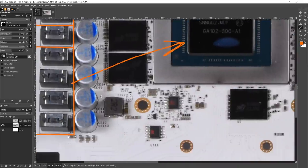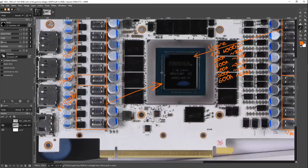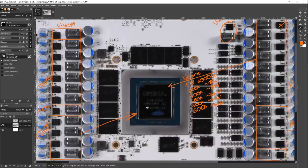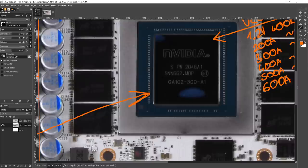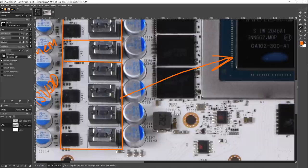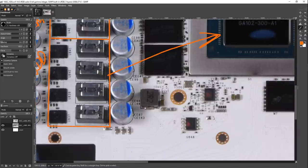MSVDD on this card is absolutely massive. I'm kind of surprised that it's all the way up to eight power stages, because most of the other cards go up to six. Going from 6 to 8 is a roughly 33% increase in power stage count, leading to a pretty significant efficiency increase. But I don't know what the MSVDD rail normally has to push in terms of current. It certainly doesn't hurt to have a bigger MSVDD rail, though I don't know how important it is that this MSVDD rail is so much more powerful.